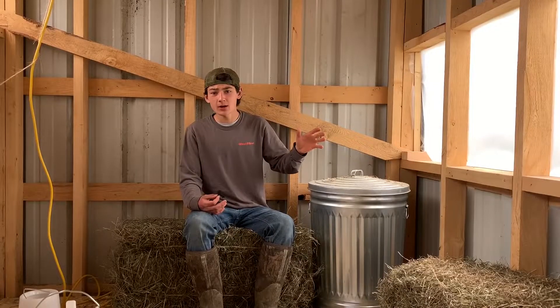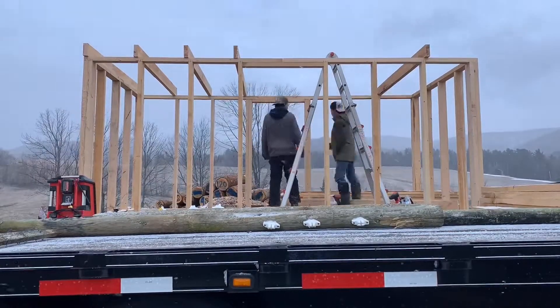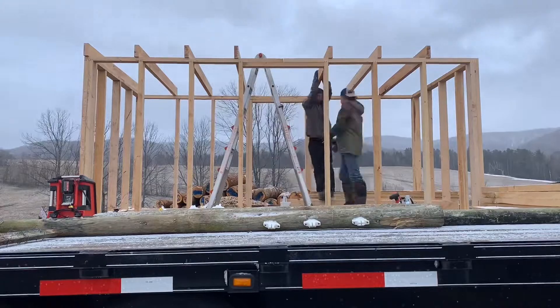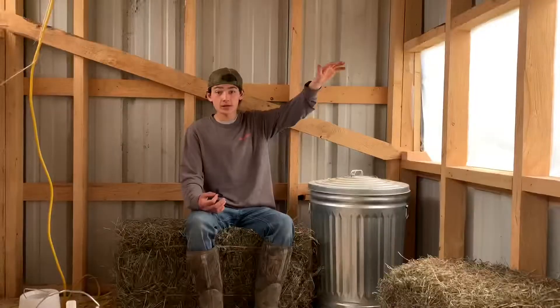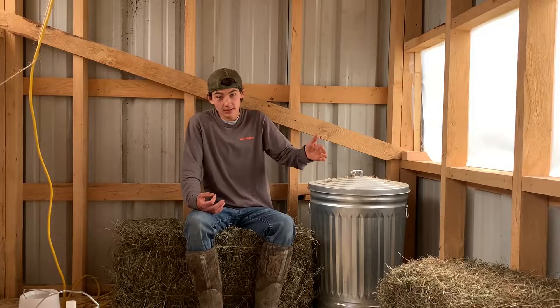After all the walls were framed, the next step was the rafters. The rafters are pretty easy — they're 2x6 by 8 feet 2 inches. If you really wanted, you could buy 10-footers and have a bit more overhang, but it's just whatever you want. This size is lighter, easier, and skinnier, so it can fit through a lot of narrow areas and gates, which is a big thing on the farm.